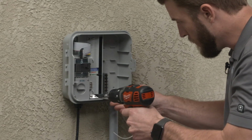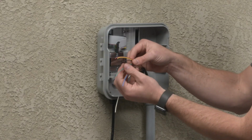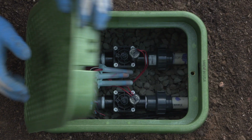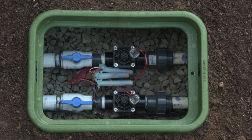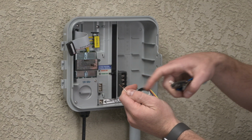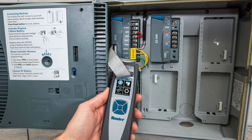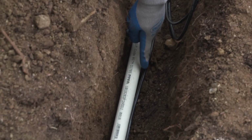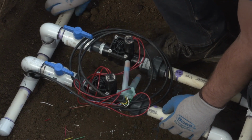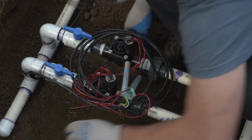After finding a good location and properly mounting your controller, it's time to wire it up. Most smaller systems can use multi-strand color-coded wire rated for direct burial. The number of wires you'll need is determined by the number of valves in your site's irrigation system, plus a common wire, plus any wire for future expansion or maintenance considerations. If installing a decoder system, follow the manufacturer's recommendations for wire size and type. Make sure you know how you'll run the field wires and sensor wires from the controller to the valves and sensors on the project. Ensure there aren't any obstructions that could cause issues when running the wire.